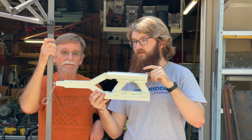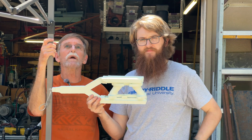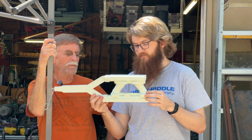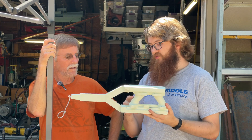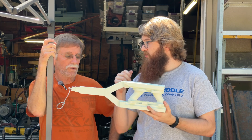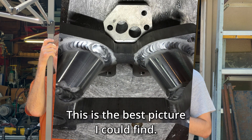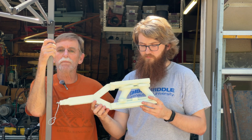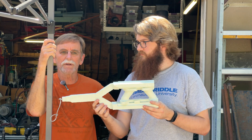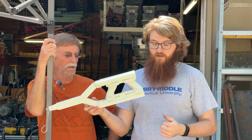We have a new pouring cup — a high-temp, ceramic, super lightweight pouring cup. We've got some updates in the tooling. The original version was tapered straight tubes — outside and inside were tapered — then angle cut. The top and bottom plates also had different diameter holes and were taper cut. It was welded with gobs and gobs of work. Really cool, but a lot of work.